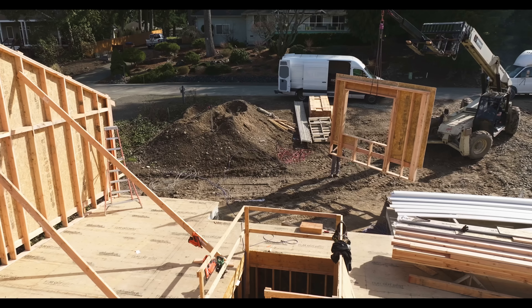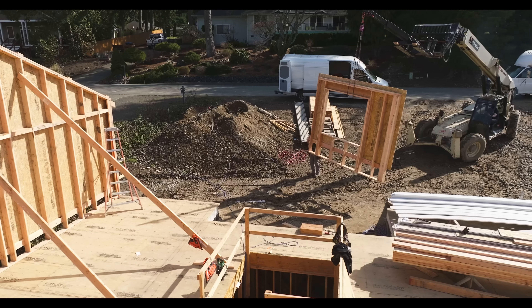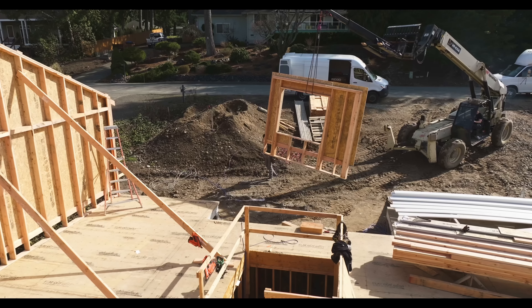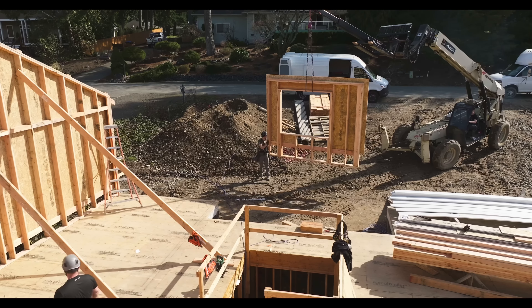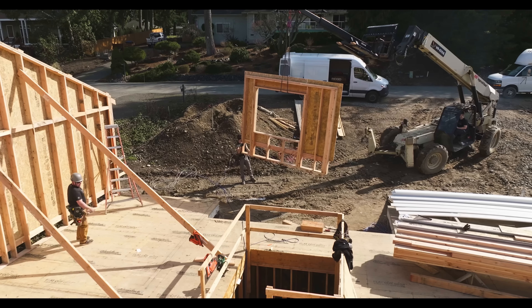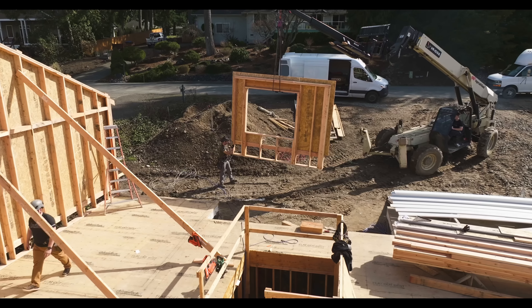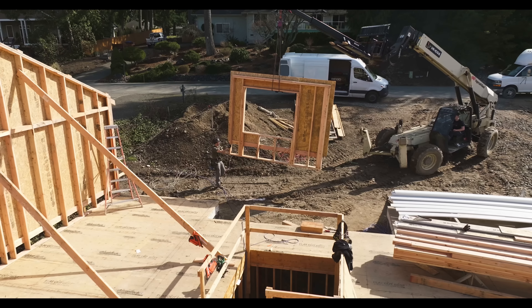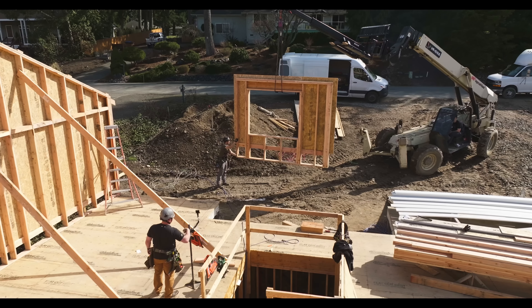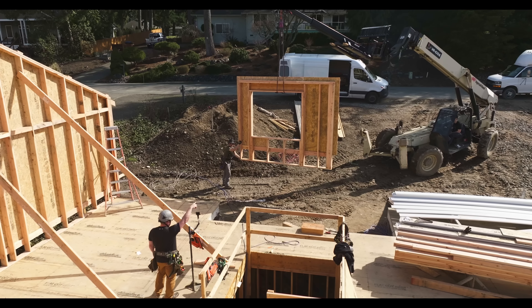A couple of things as we bring the wall over. The block line — we're going to extend sheathing from that down and cover the mud sill. The sheathing is held above the plate because it's going to nail into our bird blocks. And then single-ply Roseburg rigid LVL — laminated veneer lumber. I'm pretty proud of that joke, so I just keep recycling it.